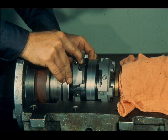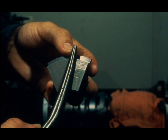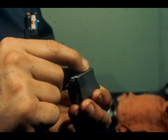Now the remainder of the thrust shoes may be installed. Before they are, check the babbitt surfaces once more to make sure there are no nicks or burrs on them. If there are any, no matter how slight, remove them with a scraper. The Kingsbury type thrust bearing is designed to operate with a wedge of oil between the thrust shoes and the thrust collar, preventing any metal-to-metal contact during normal operation. An important part of this design is the beveled radial edges of the thrust shoes. The leading radial edge of each shoe must be beveled to permit the oil wedge to form, and since these shoes are designed to operate in either direction, both radial edges must be beveled or chamfered.